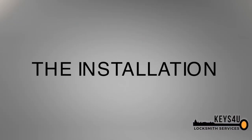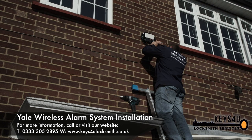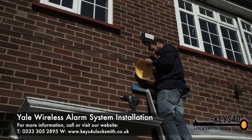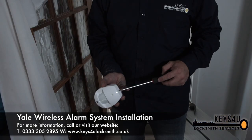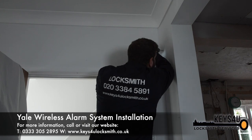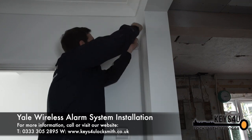Let's get it installed. First, start off by securing the alarm box to the exterior of the property. This is tamper-proof and it also lets passers-by know that your house is alarmed. The next stage is to secure the PIRs to the inside of the building. The PIRs are motion detectors, so point them to the areas where people are most likely to make an entrance into the property from.